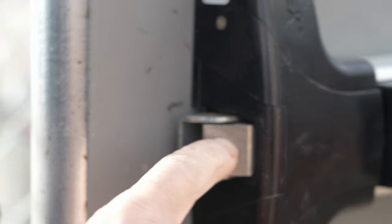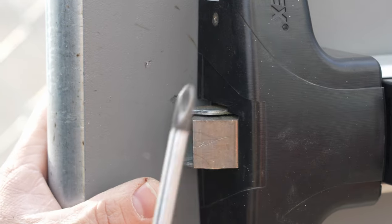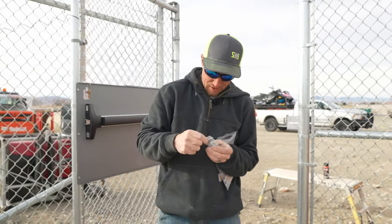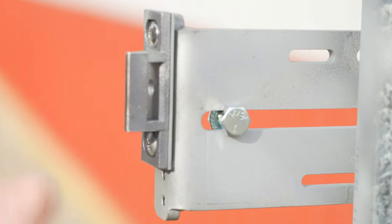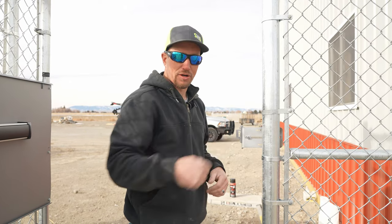We give them a little SWI key chain. This right here is the anti-tamper and this is the actual latch — this will latch into our latching device. If they're both out like this, I can stick something through there and get myself into that gate. But if this is depressed like it's supposed to be, I can't get that to suck in. So in order for that to happen, there's a little bolt about three-quarter inch long. That bolt is going to go right there and act as a spacer — it's going to keep that gate far enough away and keep that anti-tamper sucked in, so that latch cannot be depressed and broken into from that direction.